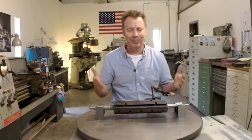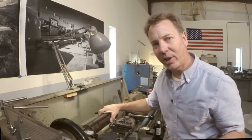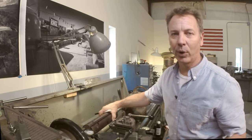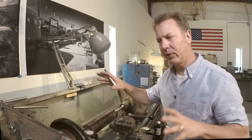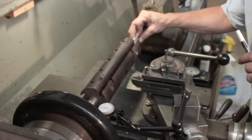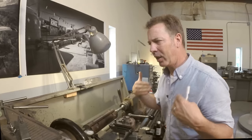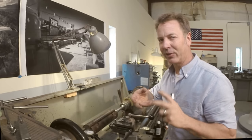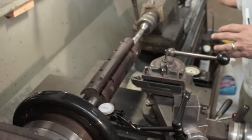This is really a great project that my friend Tom brought to me. Let's head over to the lathe, chuck it in, and find out what happens. As you can see, I already have this project into the collet. Some of you are going to ask why I'm not using a four-jaw chuck right now. The reason is it's a little out of whack — I've never cleaned it since I bought this lathe and I just don't trust it. Another thing is I would have to put some sort of protective surface around the bearing area to make sure it doesn't get damaged. So I decided to go with the collet. Because of its great accuracies and inaccuracies combined with the shaft's inaccuracies, we're going to be able to tweak this out to within a thousandths of an inch. Right now I'm also set up on this end with just a live center, kind of a little snug.